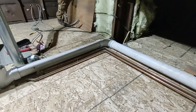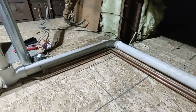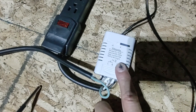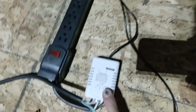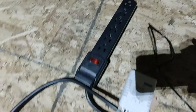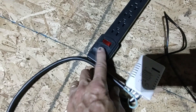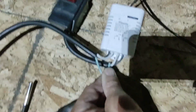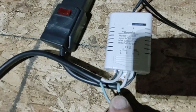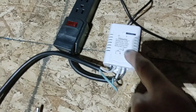I could just put heat tape on these and call it a day, but I want to be able to control it. So I've worked out a situation where I can turn these on and off and monitor them remotely. I've got one of these remote thermostatic wi-fi enabled switches which I can control from anywhere in the world. I've wired it in line with a standard outlet — this type actually has a built-in circuit breaker, a belts-and-suspenders approach to making sure nothing goes wrong. I wire the neutral and the hot into this device.